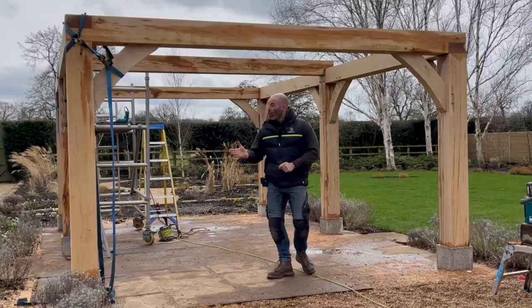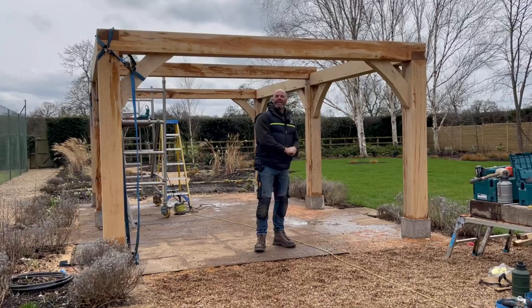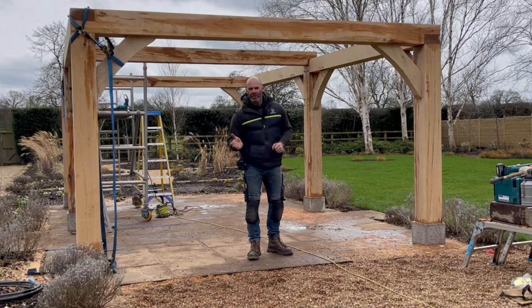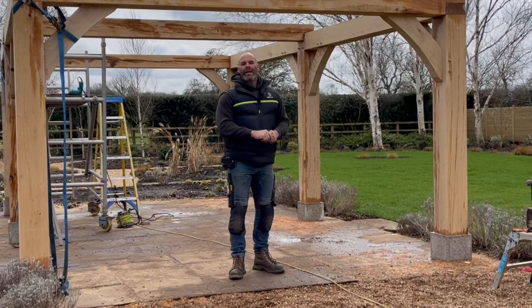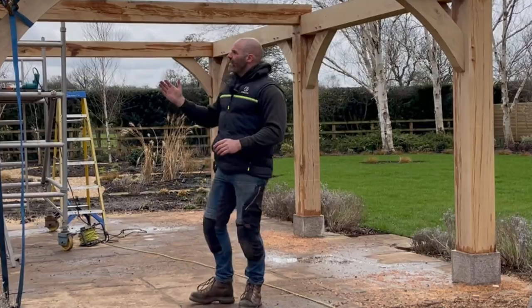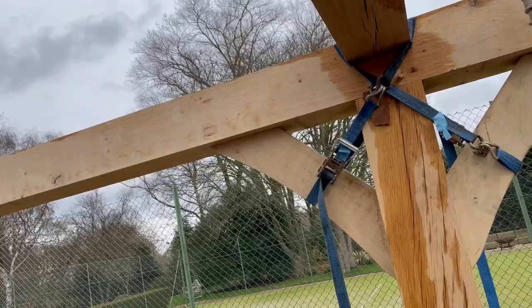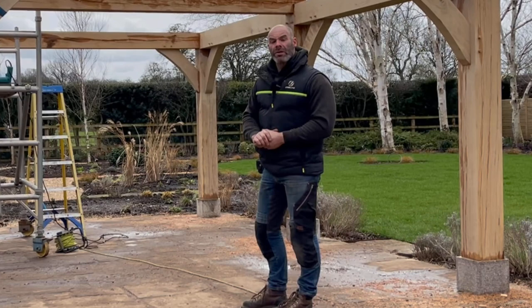Quite a lot has happened since the last clip. While we were cutting posts to length and lifting the beams into place, a heavy rain shower presented itself followed by a snow shower — neither of which is convenient for filming. When you're lifting these very heavy beams above your head using the Genialift, you really have to keep your wits about you, because although we do it safely, if it goes wrong it wouldn't end well. Yesterday was a good day — we've now got half the dowels in. All the knee braces are strapped up and all the joints are as tight as we can get them.